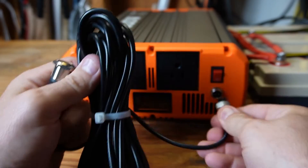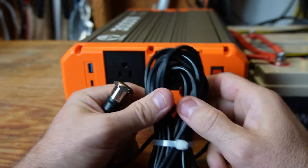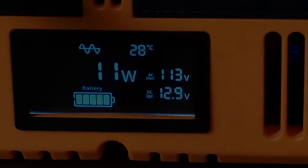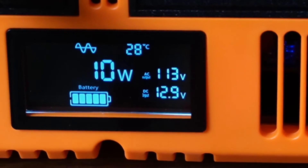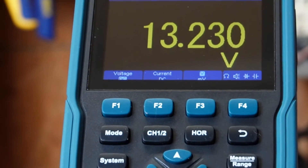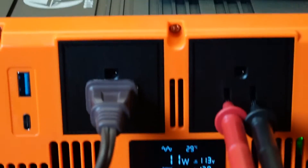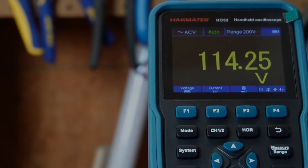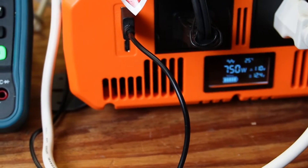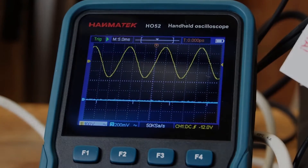Testing the remote control button — there's only one way to plug it in, so you can't do it incorrectly. With the inverter off, I pressed it and it works great. The DC voltage input on the inverter shows 12.9 volts, but my multimeters read 13.234 volts, so there's a slight discrepancy. The AC voltage shows 112 to 113 on the inverter, and my multimeter reads 114 — very close. Testing for pure sine wave with a space heater drawing 750 watts, the waveform looks good.